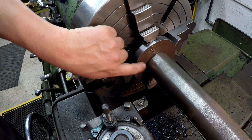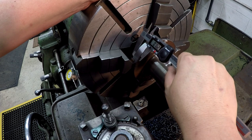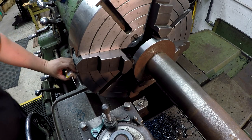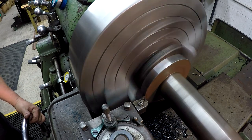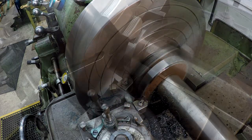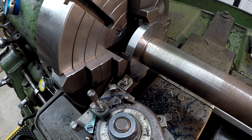I'm going to get this face to the thickness I need — get this done first, set a stop, and get this rough down close to size. We're going to finish this width right here at about 725 thousandths, so we've got about 25 thousandths to come off. We'll use the Hackmaster mag-backed indicator. We'll take a cut and then mic it to see what we've got left. We're going to take 10 thousandths on that — we'll call that finished on the width.